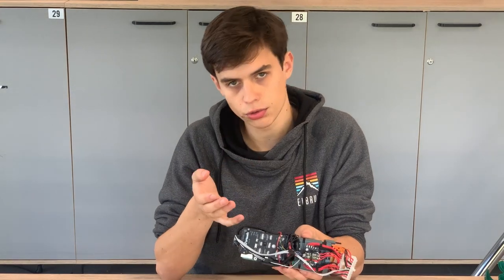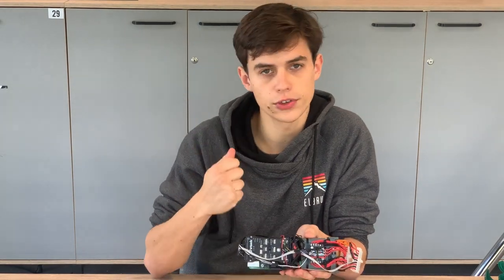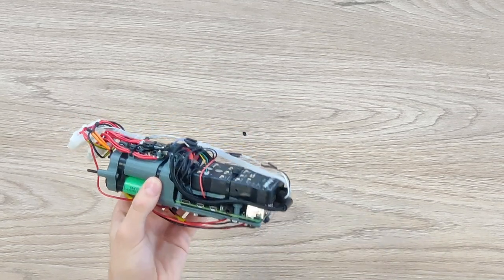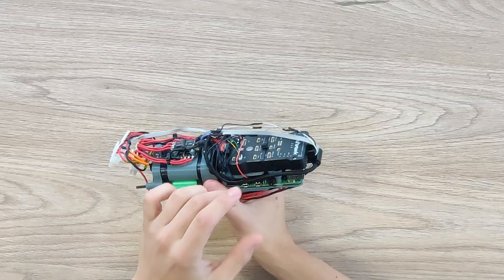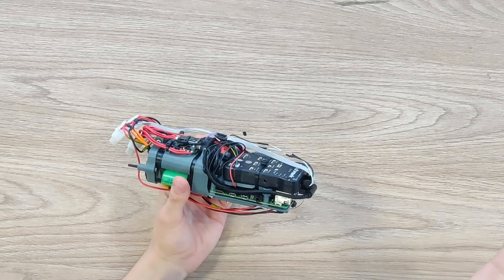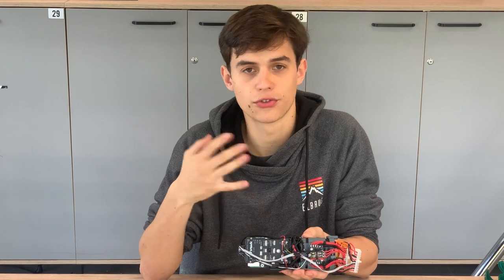The Raspberry Pi is a very crucial part of the drone. First, it allows the surface computer to communicate with the Pixhawk — it's like an interface. The Raspberry Pi also has a camera connected via USB that allows it to record and stream video live to the surface computer. Importantly, both the Raspberry Pi and the Pixhawk run on open source software, meaning you can download it, modify it to your needs, include a custom module, and upload it so your drone works differently.